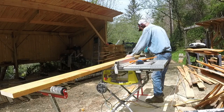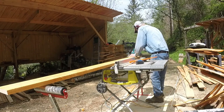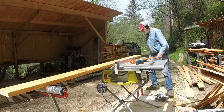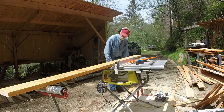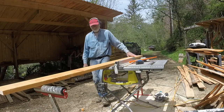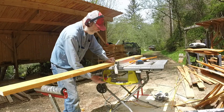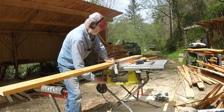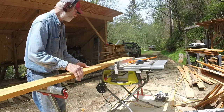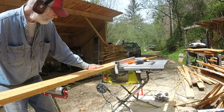Each board is just over an inch and 1/8 thick. I set the blade height on the table saw at 9/16 and set the fence 9/16 from the left side of the blade. Four cuts the length of each plank would give a square cutout on each edge. Table saws scare me, for good reason. Cutting these, though, the blade is always buried in the wood.